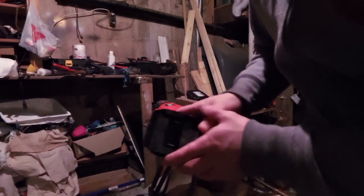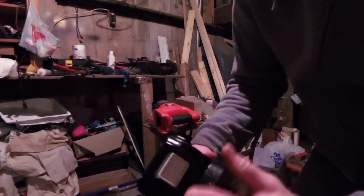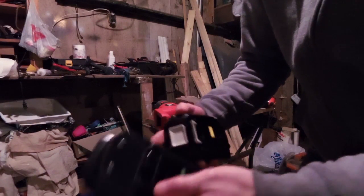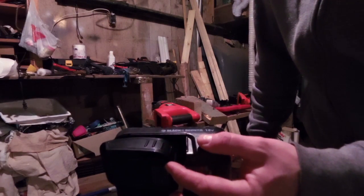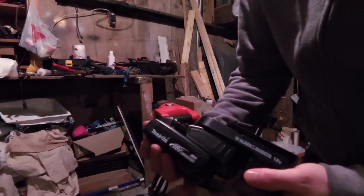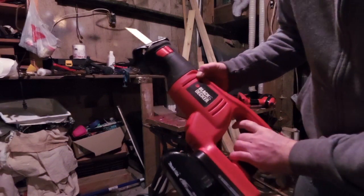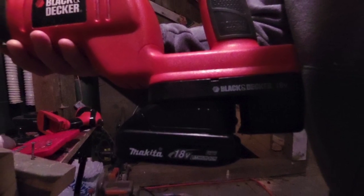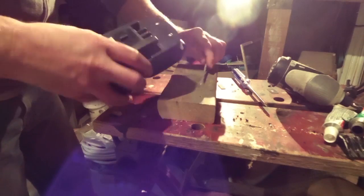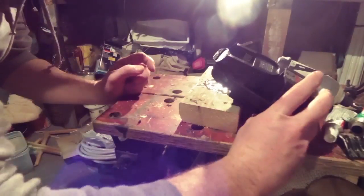I'd say that's a success - this will get me by for the light-duty stuff I need it for. Then I just have to buy Makita batteries. It's just got two screws there; I'll put some epoxy up along the side to really make it a lot more rigid. That's it - that's my conversion: 18-volt Black and Decker NiCad to 18-volt lithium-ion Makita power pack. It ain't pretty, but it seems to work. The Makita is sitting on the bottom, totally replacing the NiCad, and I'm mixing epoxy up and goobering it on there as much as I could to really make one solid object out of it so if it gets banged around it shouldn't be too bad. I didn't want it relying on just the two screws.